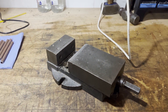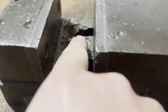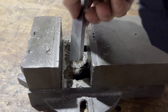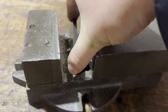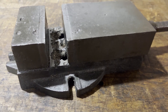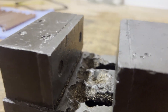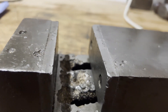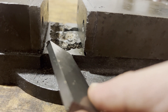It's old - it's got to be getting on for 40, 50 or more years old now. The problem though is it looks like the surface of the moon, which is fine all the time you've got something in it up against the jaws, because there is that ledge there. But if you need your parallels back here somewhere, or you need some sort of reference - say you had the jaws open to there - unless you try packing it out a bit or working off the back jaw, clock it straight, put a milling cutter in the mill, and this bit, for example, could mill out the size of the bit of metal.